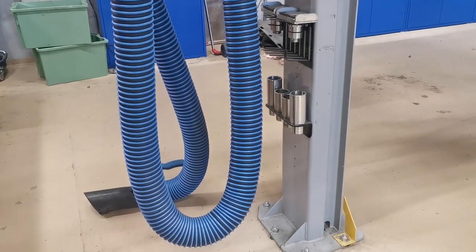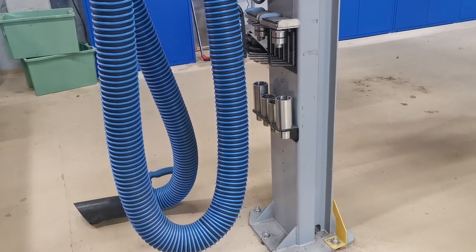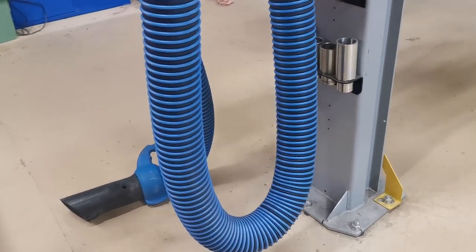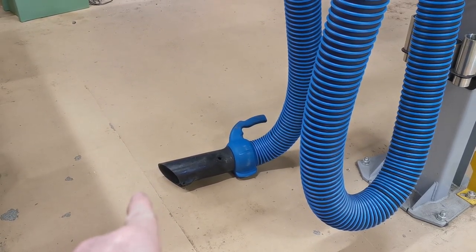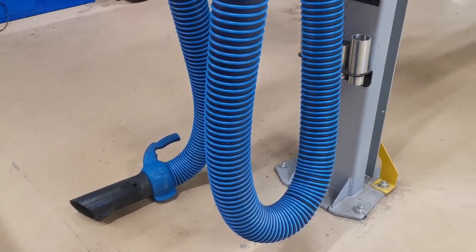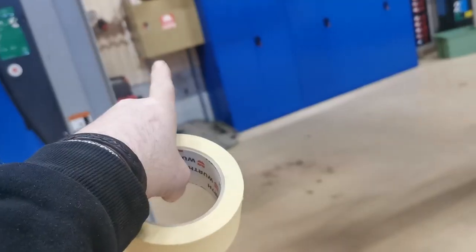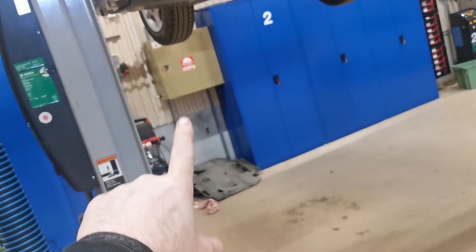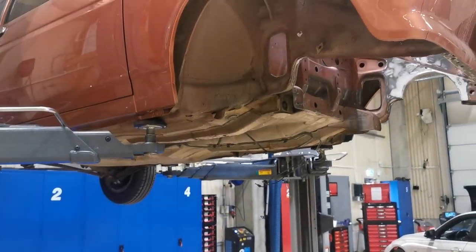At the side of every lift we've got an exhaust extractor. The plan is to put an exhaust extractor on the floor and switch it on, which means air will be pushed downwards from the fans and sucked from underneath with the extractor fan. Obviously this is made for exhaust fumes, so I'm going to put some filter material in the end so that the paint gets stuck to the filter and doesn't go into the fan system. I also have a fire hose with water trickling across the floor going into the drain, so any paint dust that comes down will get washed away. As it's water-based paint, it's fine.